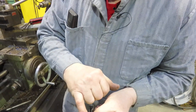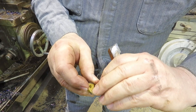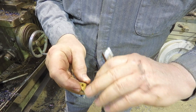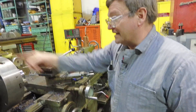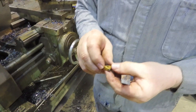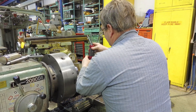I don't like doing that most of the time on these form tools. A lot of times I'll buy ones with chip breakers molded in them from the factory — a little one on the various carbide inserts. You can see there's a chip breaker, a little ledge there for the chip to hit. They have that figured out so that for whatever steel it was planned for, this would be perfect with this fancy little shape. It's not a deficit most of the time — it does take away a little bit of the edge strength, yet it gives you a little bit more positive entrance. A chip breaker is not the same from one insert to another.